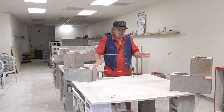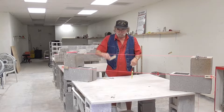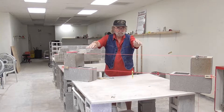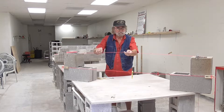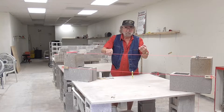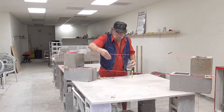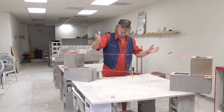Now for demonstration purposes I've got those wooden corner blocks on the outside. I always lay block with the line on the outside. In other words, I don't want to lay the block over the line — I want to lay the block to the line. It's a lot easier.